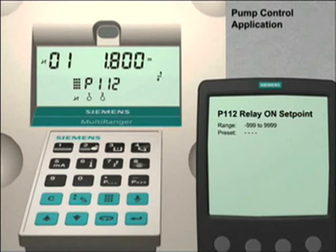Now let's program the on set point for pump number 2. Press the next display key. Dash dash is visible in the index field. Then press the up arrow to go to index number 2 or relay number 2. We are going to have pump number 2 come on after pump number 1 and only if pump number 1 cannot pump down the liquid level on its own. We will program relay number 2 to come on if the liquid level rises to 2 metres. Enter 2 followed by the enter key. The display will now show 2.000 metres. Pump number 2 will now come on when the liquid level rises to 2 metres.